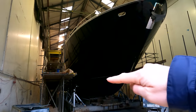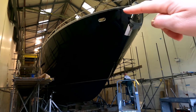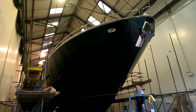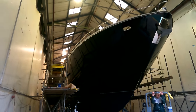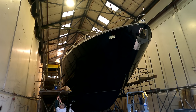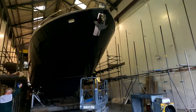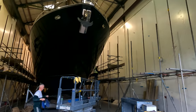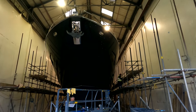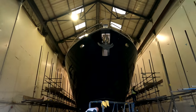Just to recap, they painted from the anti-foul here all the way up to the top of the gunwales where the rubbing strake joins. Three layers of primer, three layers of top coat, and then three layers of clear coat over that, and we've got an absolutely mirror finish on here — they're absolutely stunning. We've got the surveyors up on the scaffold there just signing off the gloss finish and also any small imperfections.